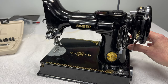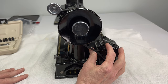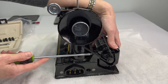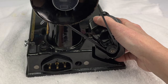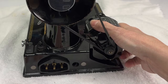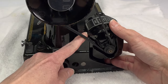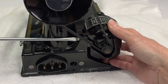What we want to do now: how much tension or slack should you have on this belt? I kind of like to do the finger test — it shouldn't be too tight, it should have a little bit of spring to it. A lot of times the best way to adjust the belt is to loosen up this motor mount screw here and just let the motor relax a little bit. I'm bringing it down a little further — now this is starting to get a little more taut as I pinch it. I kind of like it a little more relaxed, so I'm going to raise the motor up here in the mount and tighten that motor mount screw back down.